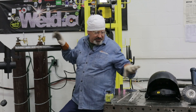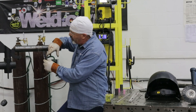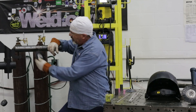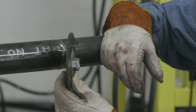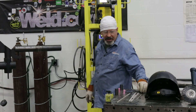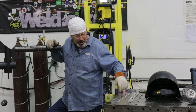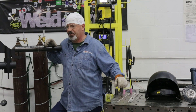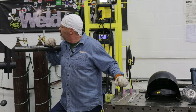A couple cool products — I'm not selling this stuff, I just want to tell you how cool they are. This thing is actually designed for doing thin work on edge. It's a cut-off wheel, but it'll also grind down in there quickly. And then the encapsulated disc — you can get in here and get on the edge. This thing is not going to spit wires because it's encapsulated, but you can get into it pretty heavy and it won't flare the bristles out. I've had a lot of people ask about stuff we're using on camera, so I hope this helps. When you practice, you'll get really smooth and really good on this. These things heat up really quick, so you've got to watch your amperage — that's why I dropped mine way down to 70. We're fused in pretty nice.